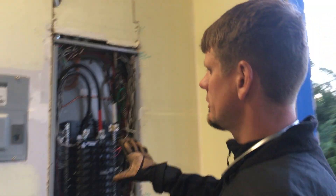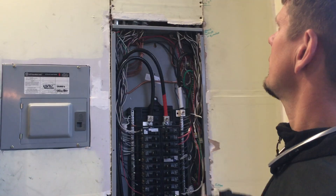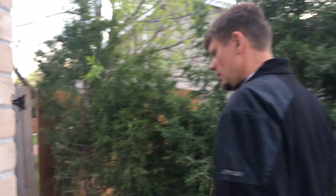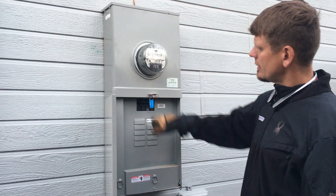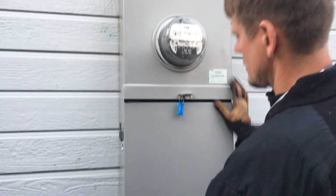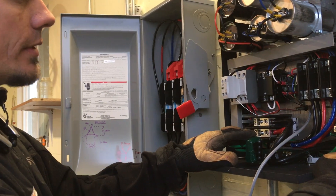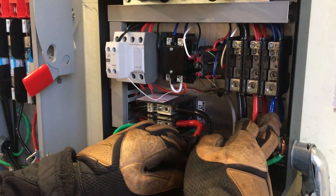When I got here, they had a 125-amp panel. We needed 90 amps to feed this machine. Don't mind the drywall — there's a bit of hacking we had to do that he'll get mudded in time. This panel had to be changed out to a 200-amp service. Back-to-back, we put on an all-in-one unit: it's got a meter main, 200-amp disconnect, and breaker spots for the future — like a large compressor — with plenty of amps to do that. Grounding everything with slip sleeve, of course, as you've seen in most of my videos.